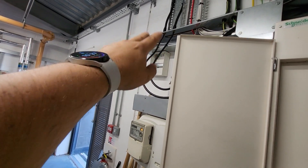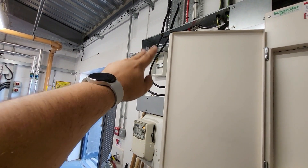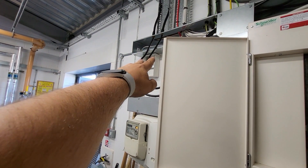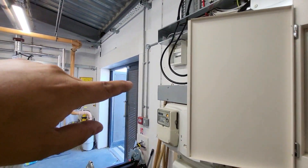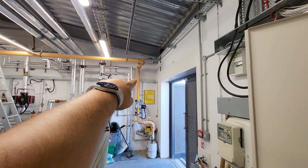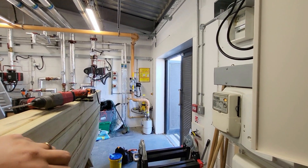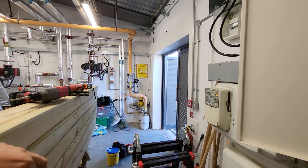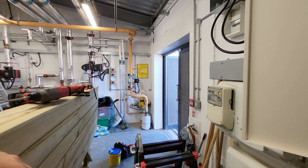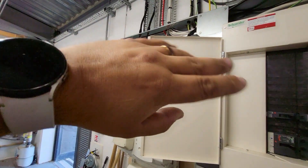We're going to get the RCDs in — that process is covered on the last video. We're trying to keep these to around 15–20 minutes, so we won't show that here. We've got two four-pole RCDs in there, coming out and across into two MCBs which protect those circuits with overcurrent protection leading outside to our charge points. Nathan's out there now looking inside the units and making sure they're wired up correctly — he wants to have a final check. We'll run through the test process once this lot is all connected and energized.